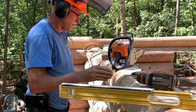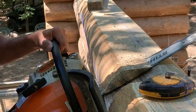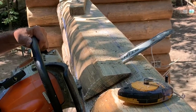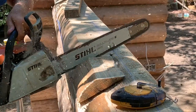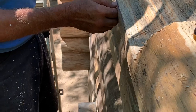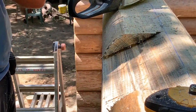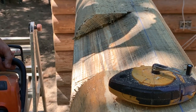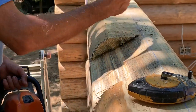I stop and go about a foot, smooth it out good, and make sure I'm staying on. I stayed above my line just a little bit on both top and bottom, and I feather that down to the line — it's been dead on all the way down. He's only going to the blue line on top, which is the center of the wall — not actually the center of this log because it has a bow in it. So to keep your roof line straight you've got to go by the actual straight stuff.